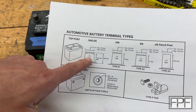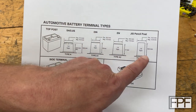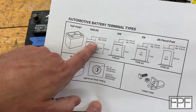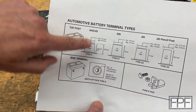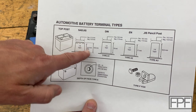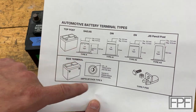I grabbed the calipers and it looks like it's a one-to-nine taper. In fact, they're all one-to-nine tapers — it's just a different part of that taper. So if you were to continue this taper further up, you'd eventually get to this section up here. Our positive is bigger than the negative: 17.5 millimeters diameter at the top, whereas the negative is 15.9. Looks like they're both the same height. I'm guessing this is probably the mating section of the taper — it says 15.9 millimeters minimum. And the whole post including the base and the rounded part at the top can't exceed 18.6. So we should probably design around the mating part because that's the part we know is going to be the same, and maybe just allow a little extra room at the top.